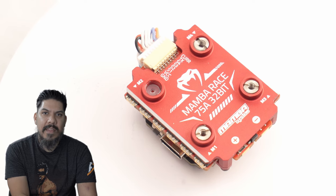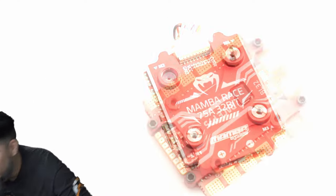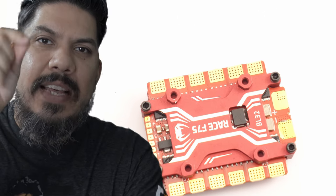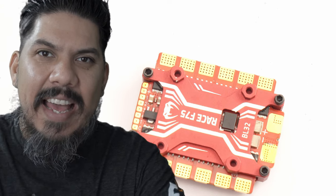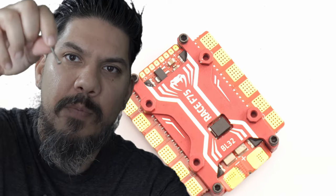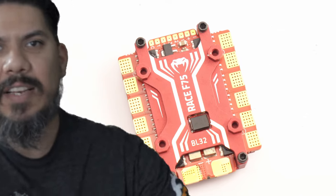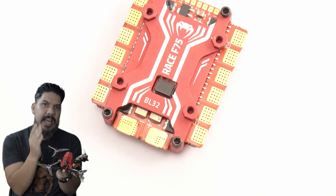Speaking of that, that means that your screws are not going through the entire stack. You see this screw, this steel screw? This was in that Kakute that I hit so hard. And that is well known to be an almost unkillable combo, but because I put so much shock on the board, enough to actually bend this screw, I actually messed up some of the chips by eliminating a single screw that's running that tall.